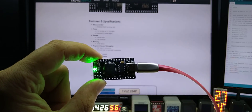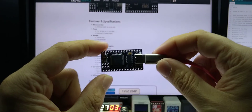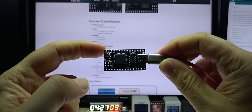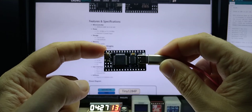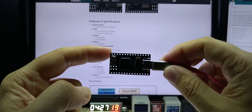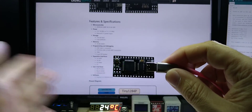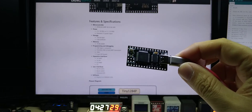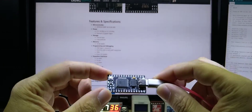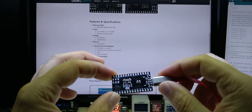Let me upload the famous blink code, just a little bit faster. You use the Arduino IDE, and MightyCore has all the board definitions you can add to your Arduino IDE so you can select the port in the Tools menu. Now you can see the code getting uploaded — and that's it. You don't need any external USB-to-serial adapter; you connect it to USB and you're done.